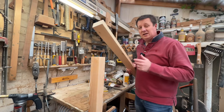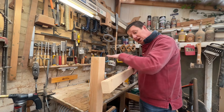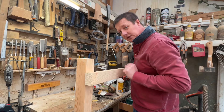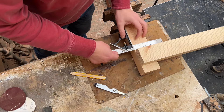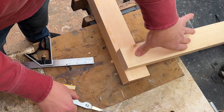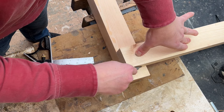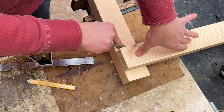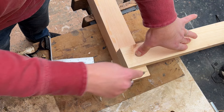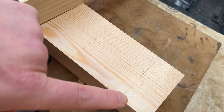Let's say you were building a free-standing shelf unit and you wanted a post with a rail to put the shelf on top. It'd be nice if we could recess this piece into this piece. First, put the rail where it wants to sit on the post, make sure it is nice and square, hold it in place, and use a knife to lightly run down each side to mark off exactly where that cut is going to go. Do a few passes just to make sure the mark is definitely there, and there's our width that needs cutting.